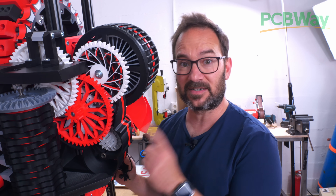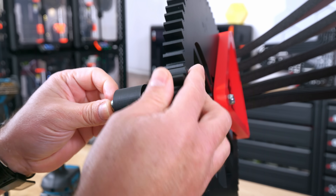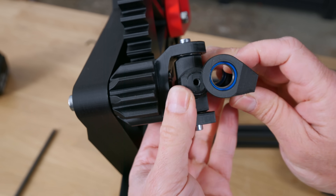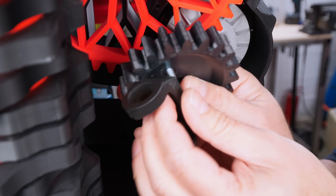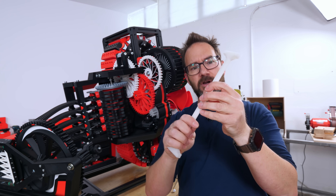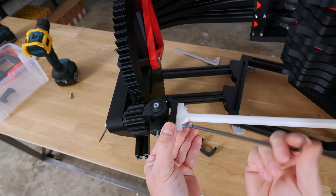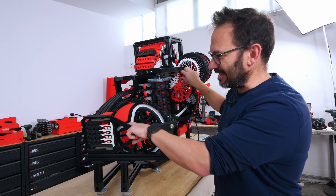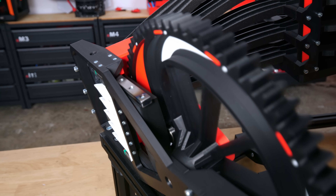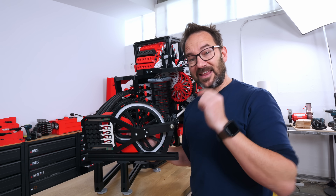Now let's get some power from here to there. I need a bracket in here for this gear that will transfer the power that comes from the motor. And after all these changes it's not aligned with the motor anymore, so I printed a few parts to make a cardan that will absorb the misalignment. I printed this shaft in pure nylon, which is quite flexible and I hope will absorb any impacts during the rotation of this gear here, which I don't think is going to be smooth. The wheel is jumping a bit whenever the bearing reaches this low point in here, when it has to do the sudden change of direction. I think I can solve that by adding some weight, some mass to this wheel in here, and I think I know how I can do that.